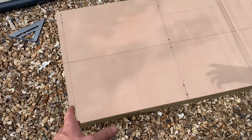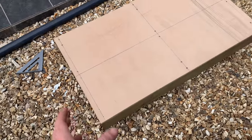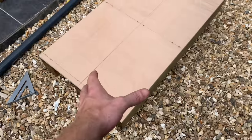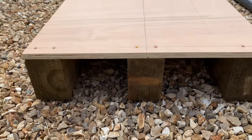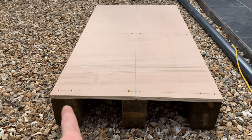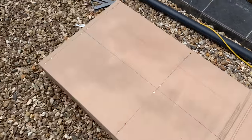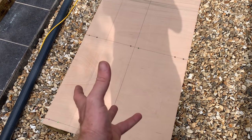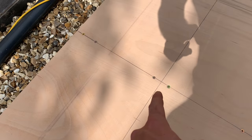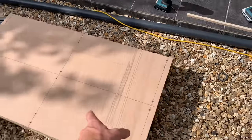Right, so there we go - it's all knocked up. I've used three of those lengths, which will be more than strong enough to hold the weight. 18mm ply, 150mm sleepers - I could brace it across the middle as well but I really don't think that'll be a problem. I'm a bit OCD on my screws - I marked an inch in on the top, drew a straight edge to get the centre point, so all my screws are equal distance apart. I countersunk the heads and pre-drilled with a 6mm bit, then put 100mm screws straight through. Happy days.